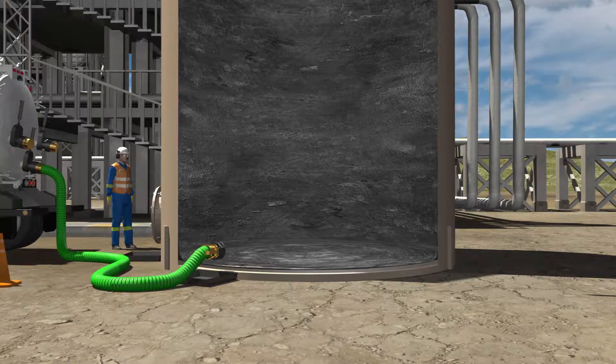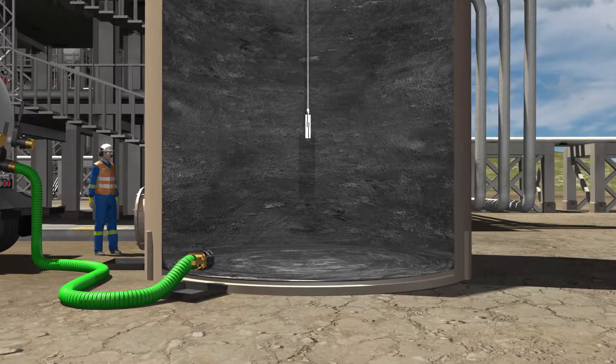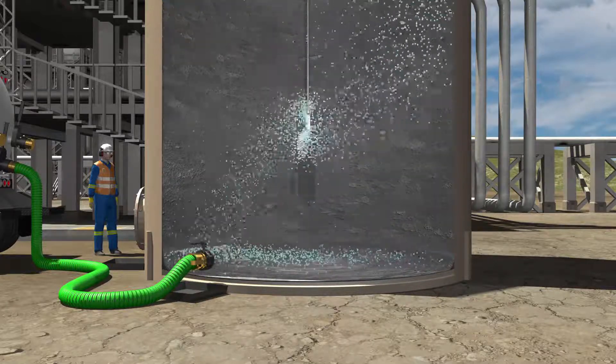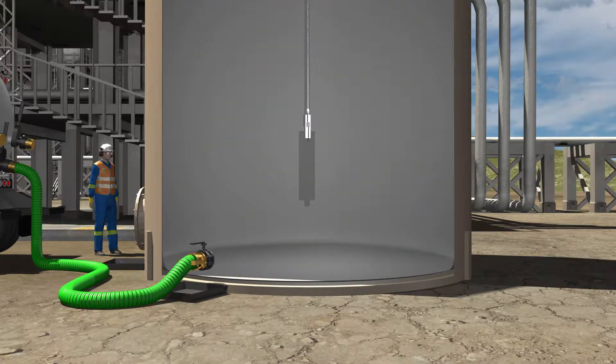With the lines in the proper position, the chosen tool can now be positioned in a central location within the tank. The wash tool is turned on and the gamma jet or 3D tool begins washing the walls of the tank. Once the chosen tool has completed the cleaning, the crew will shut off the gamma jet or 3D tool and ensure all interior walls are cleaned. Upon confirmation that the walls are cleaned, the crew will disassemble the apparatus and remove the gamma jet or 3D tool.